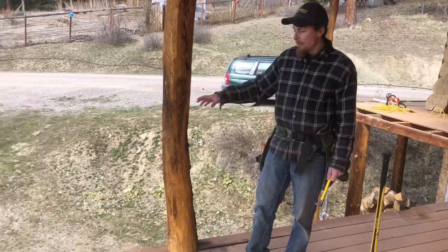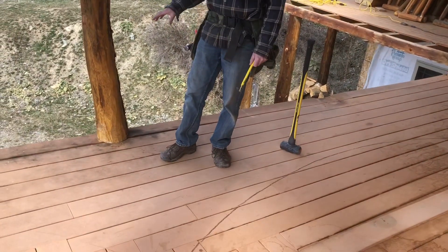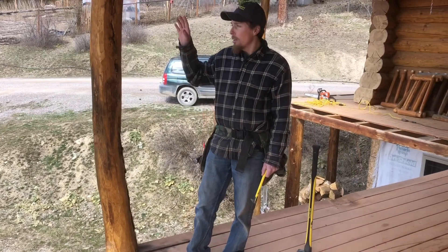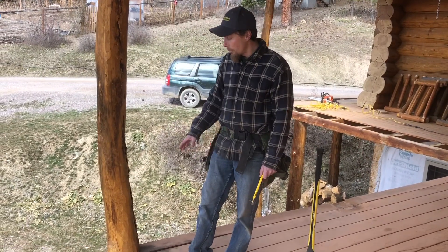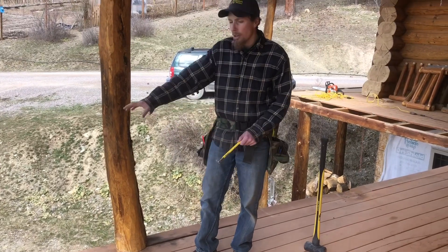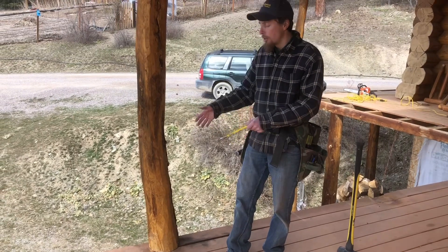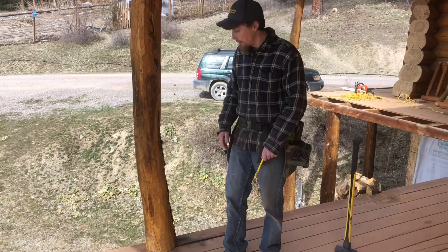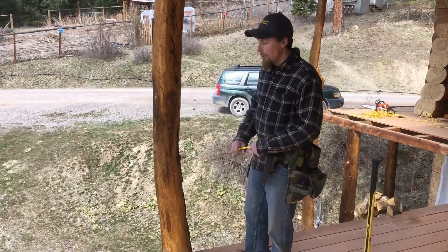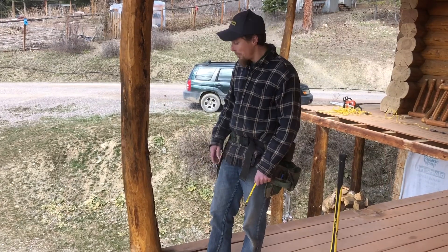Eventually we're going to replace the deck — we're just not really fond of it. It was a bad move when we bought it. So we're actually going to use rough cut 2x8 lumber that we cut at our mill. We're ripping out the outside couple rows so we can install the first couple rows of boards, so when we put our new posts on later, we don't have to pull them off to replace it. We're putting on the new couple rows, then we're going to put our railing on and move on from there. It's a job — here we go.